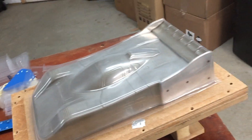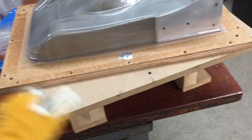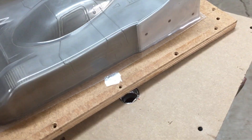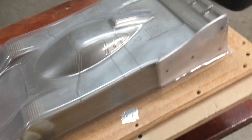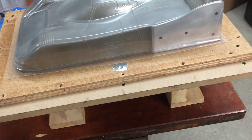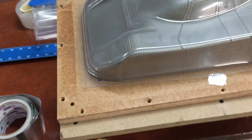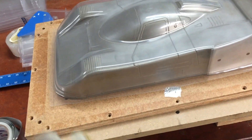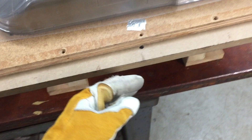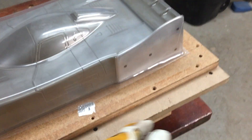Probably should have thought about this, but now I've got more experience. I've redesigned things, looked at it differently and done something I think is better. Typically what you have is your mold or buck attached to a platform like this, and this platform stays on the thermo forming or vacuum forming machine all the time. It's got a hole in the center that you draw air through, or push air in when you're trying to eject the plastic off the mold or buck. But right here along the perimeter it doesn't provide a very good seal for the vacuum or the air eject.